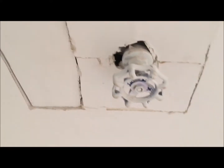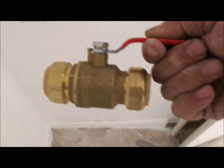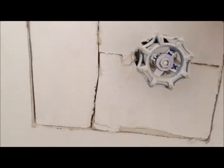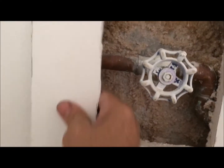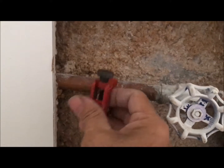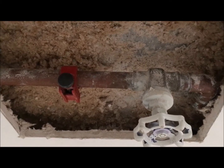We got a bad water valve. What we're going to do is cut a hole — you can see it's already pre-cut — and we're going to put in a SharkBite water valve. We're going to go through the process: get a pipe cutter and cut it straight like this. Remember, turn off the main water valve before you start cutting.